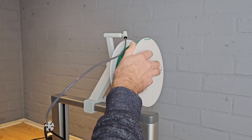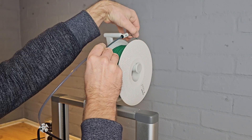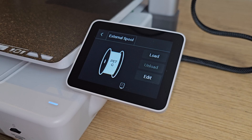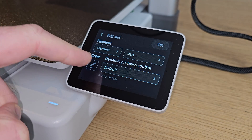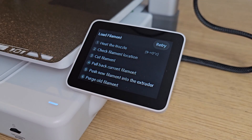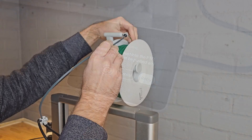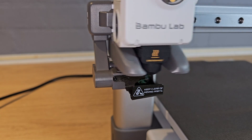If you don't have the AMS then sit the filament spool onto the external spool holder and manually feed the filament down the filament tube until it's just above the tool head. Then use the printer's screen to select the filament page and then the external spool tab. Here you can enter the filament material and colour, and you also need to load the filament. When you select load, the printer heats the hotend up and then prompts you to push the filament down the tube at the right time. It then does the rest by purging a bit of filament and then flicking it away using the wiper.